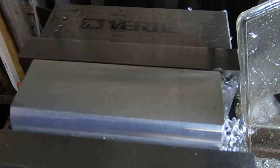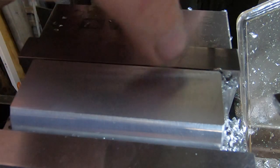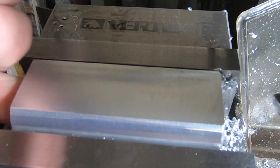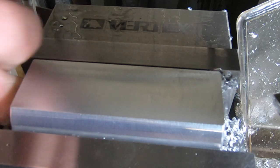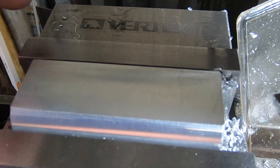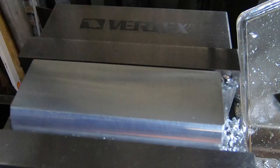Okay, over to the mill drill now, and we've got to put a threaded hole at the inlet, where it inlets and exhausts out of a 4mm hole, I think it is. And it's got to have a tapped 8mm hole, which is a bit of a pain in the ass to deburr the inside of the hole once it's drilled and tapped, but anyway, it's the way it is. I should have really done that bore afterwards, but I was worried how I was going to hold it to get it all concentric again. But anyway, I'm sure there's a way to do it.